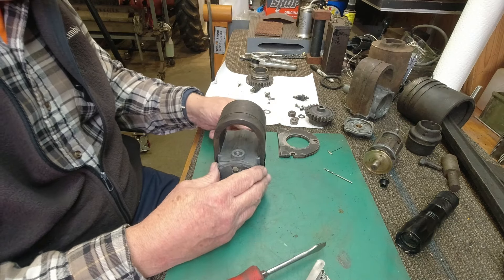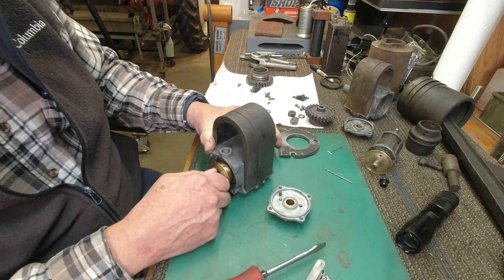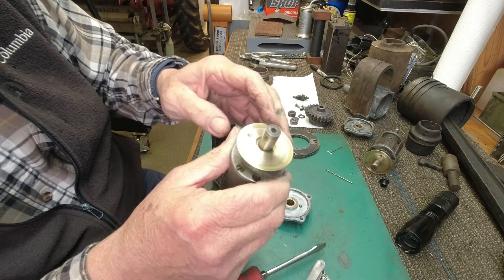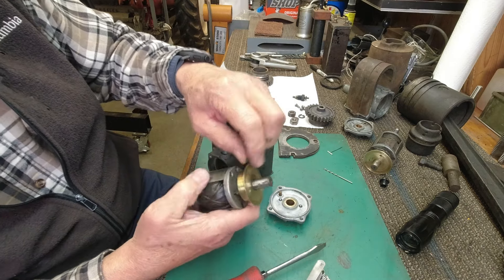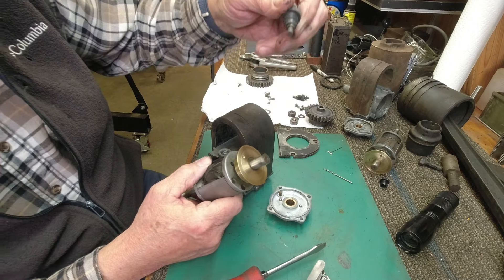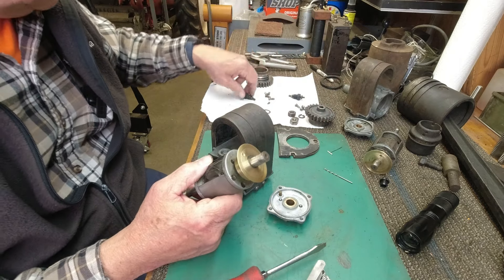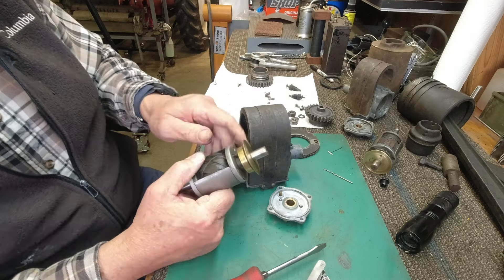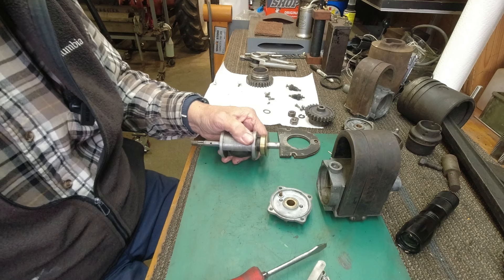We're going to go with this assembly. I'm going to go ahead and assemble it back together, lube it. This slip ring looks great — I cleaned it up real good, no deep grooves. Both sides look good. I'm going to electrically test it for continuity and test both brushes for continuity — hopefully I've got a couple of good brushes. Then I'll show you how I test it.